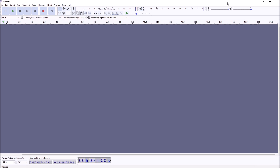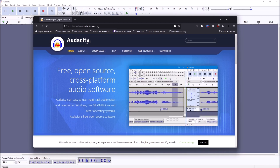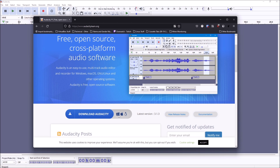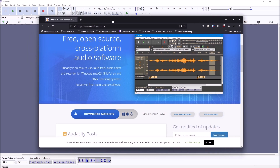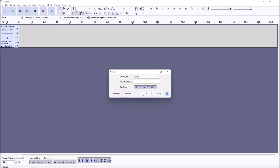The concept is simple. You download and install Audacity from audacityteam.org — it's freeware, available for Windows, Mac, and Linux. It's a great tool and one day I'll go through all of its features, but for this quick video I want to show you how to generate white noise to calibrate the balance, bias, and level. You can use white noise, but there's also pink and brownian noise available.